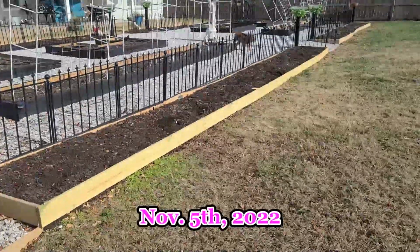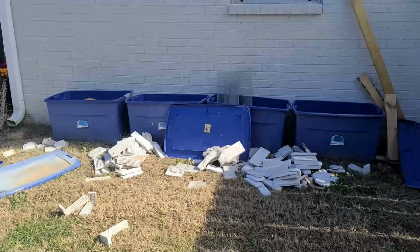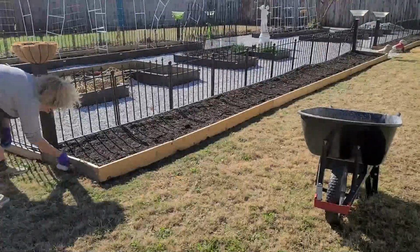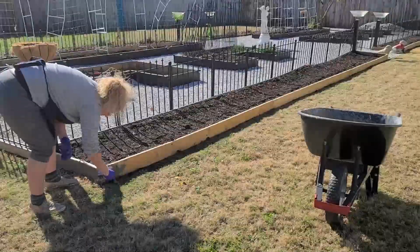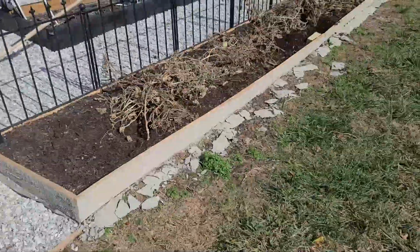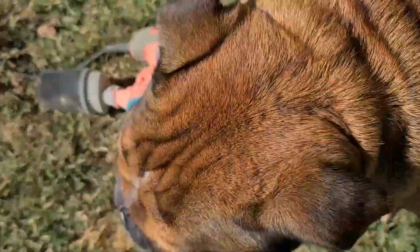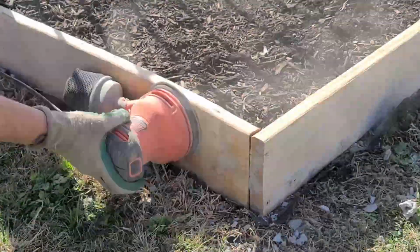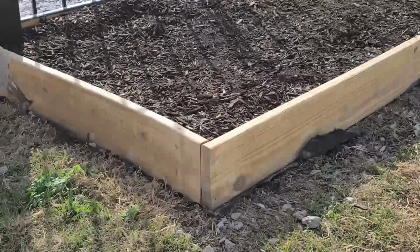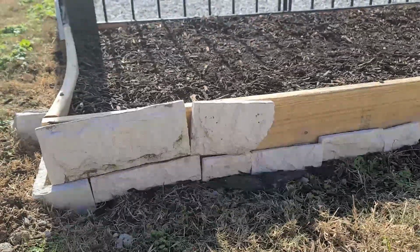I had a very beautiful 70 degree weekend and thought I would try to put the veneer stone I brought from my previous garden on the cut flower beds. The last time I attached the stone, it was on cinder blocks. This time would be wood. I applied my scratch coat on and let it sit for 12 hours. Came outside the next day to it having fallen off. Realized the wood was too smooth. I removed any mortar that was still attached and sanded the wood with coarse sandpaper. Then I took my 5-in-1 and really roughed up the surface. I wasn't able to do any more because the cold is officially staying. But here's a little glimpse of what it will look like.